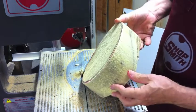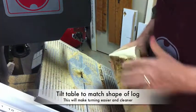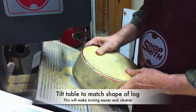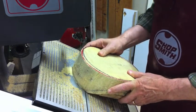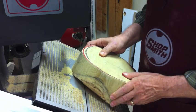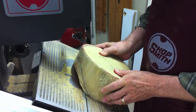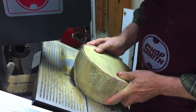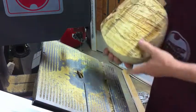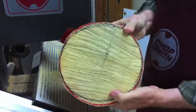Now that that cut is finished, we have the scrap off the outside. I'm going to make a second cut, and this is really one of the important things I want to show you today. If you tilt your bandsaw table to match the angle as close as you can to where the log was shaped, it's going to allow us to take off all of that extra mass and weight. It'll make our turning easier, there'll be less mess when we're finished turning. I just angle the table, stay on the line, keep my hands well away from the path of that blade, and just follow it around. As you'll see, I've reduced the mass of that bowl by quite a bit — all that material would have ended up something I'd have to turn on the lathe, so this makes lathe turning go a little quicker and easier with less mess.